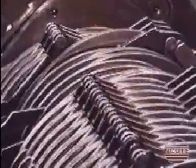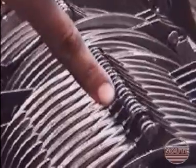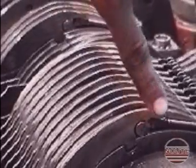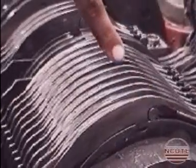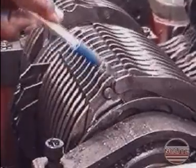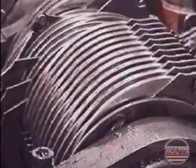Spring-loaded catches are mounted on one side of the crank unit, connecting the coupler ring. Here is a clear view of the catches. The mounting point of the catch on the crank unit and the two carrier grooves on the coupler ring are seen here. By pressing the catch at this point, it results in releasing the projection from the carrier groove, so the connection between the coupler ring and the crank unit is withdrawn.